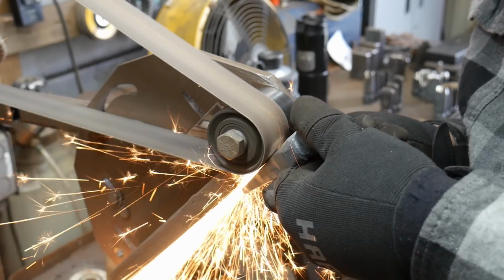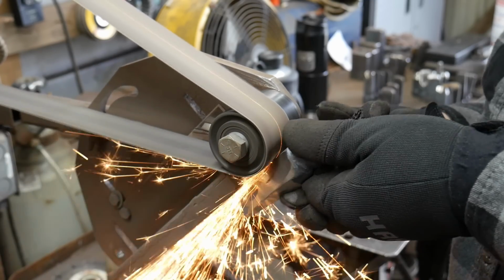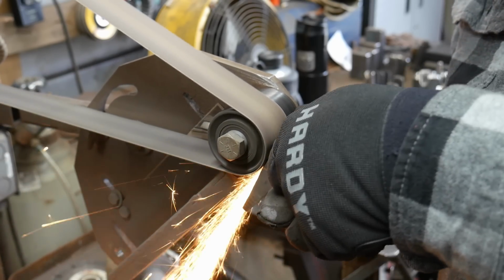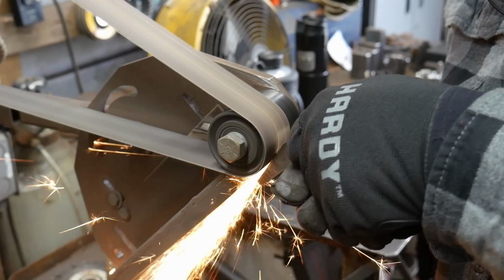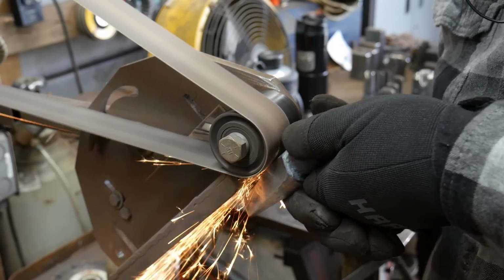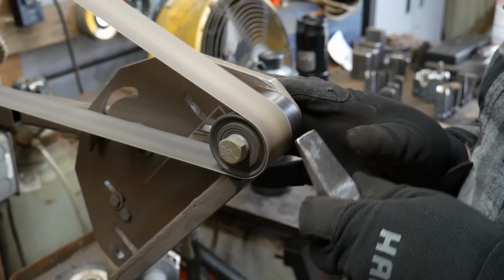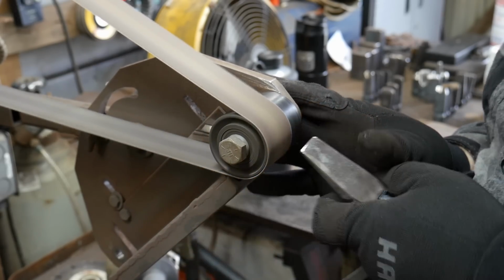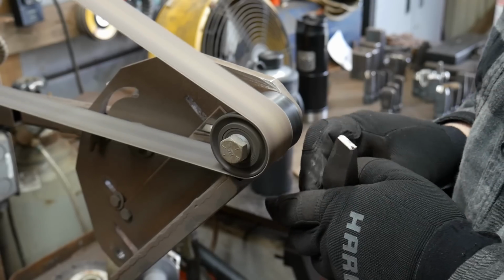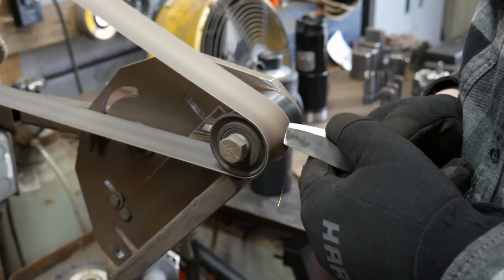So once we get all the sides trued up, we're going to grind a 60-degree bevel on one leading edge. That's kind of the value of a butcher tool. A butcher tool is unlike regular chisels. A chisel has two leading edges, so it's got a central ridge, whereas a butcher is meant to push material in one direction or another. So in the case of a straight butcher, it's going to push it to either the left or the right, depending on how you have the tool facing. That's where the material is going to upheave to. And then it can be planished down later to leave a ridge exposed, or maybe a central vein, things like that. So that's the value of having a straight butcher.